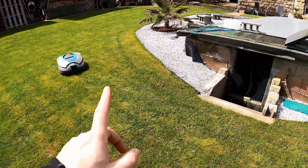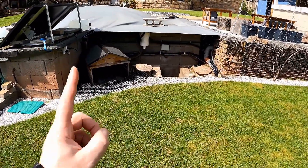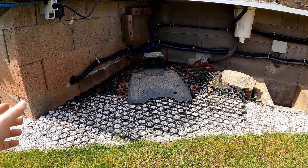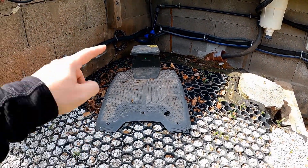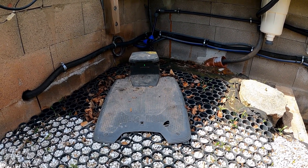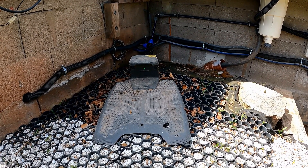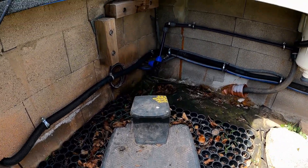Before I start searching in the lawn, here is a simple tip on how to find out which boundary cable or control cable is damaged. I start by carefully looking for the defective cable, first by figuring out whether it is the side boundary cable or the control cable that is defective. I have already cleared the charging station and moved the garage aside. The green light on my Gardena charging station is on, which means the circuit from the side boundary cables is intact. But there is still damage since the robot is not moving, so I already know it is the control cable.